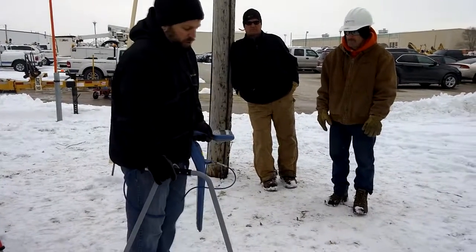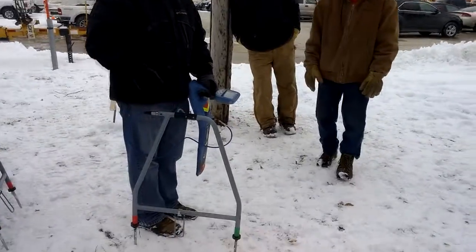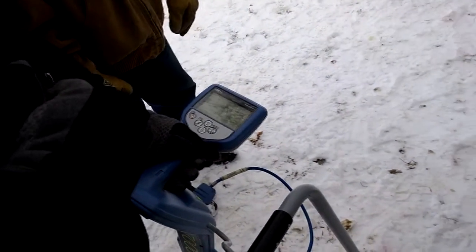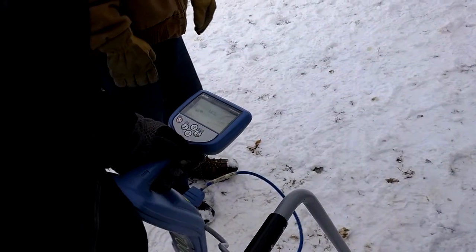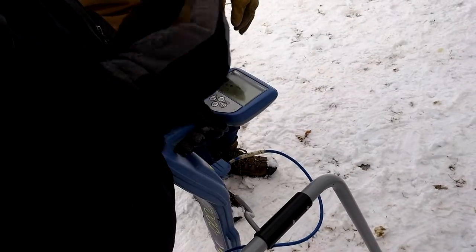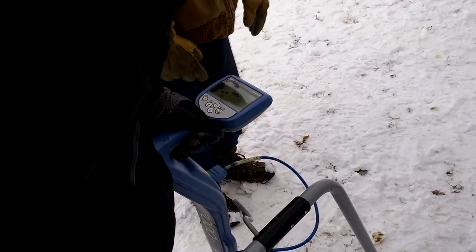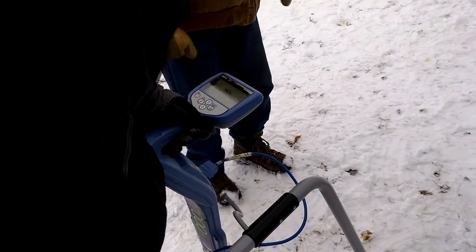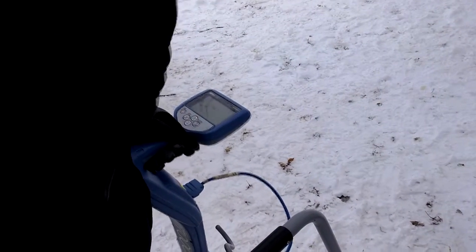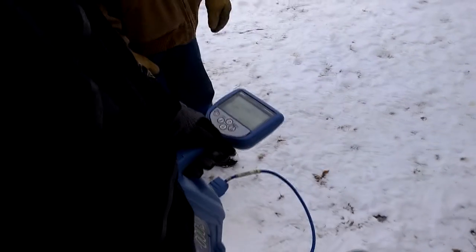Here we're over the top of the line and I have an arrow showing me forward, pointing out that way, with a decibel reading of about 57 decibels. Remember, that ground rod is about the same decibel level as the fault down the way. The decibel level is going to start high like this because it's still picking up the ground rod, then plateau off once we get about halfway to the fault, and then the decibel level will start to climb back up. When you see it come back up, you want to shorten your intervals with the A-frame because you know you're getting closer. Right now we have a 57 decibel level telling us to go forward.